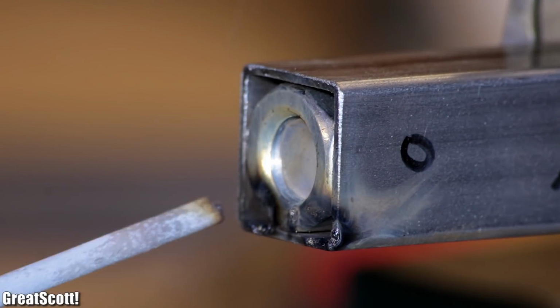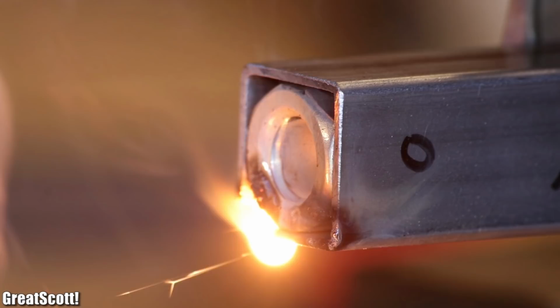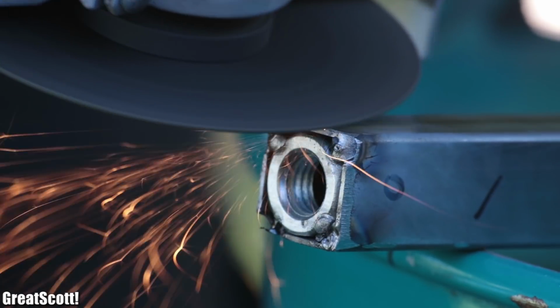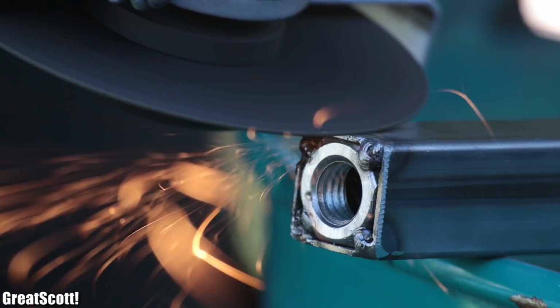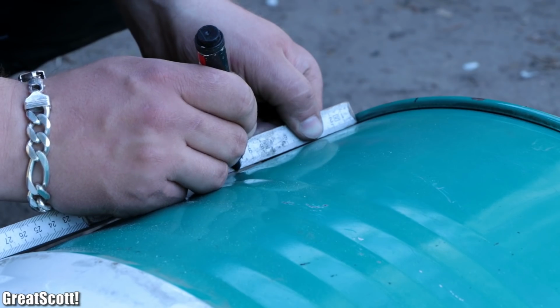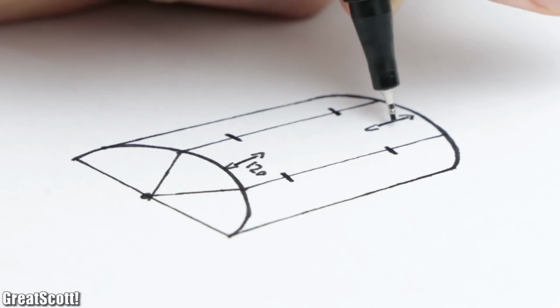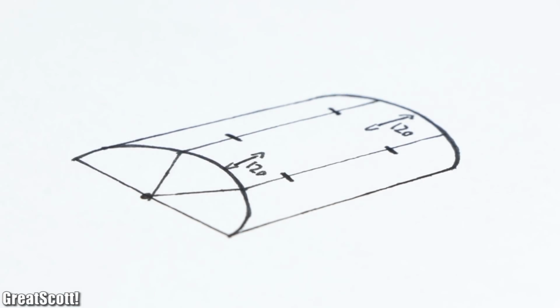And as soon as one nut was welded to one square steel more or less successfully, we made everything a bit more pretty with the angle grinder treatment and continued by marking the 4 mounting holes for the legs 12 cm apart from the top and bottom piece.